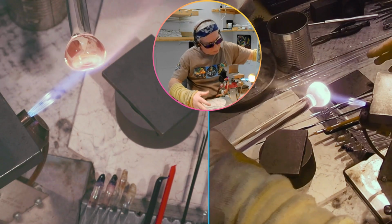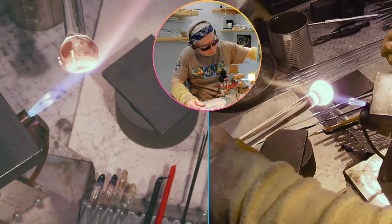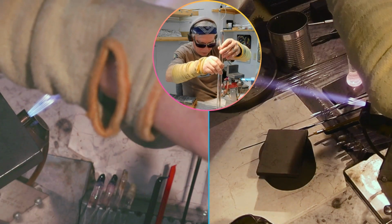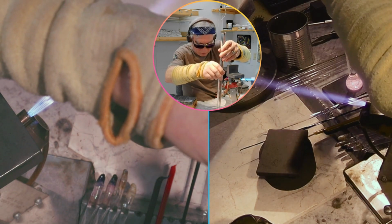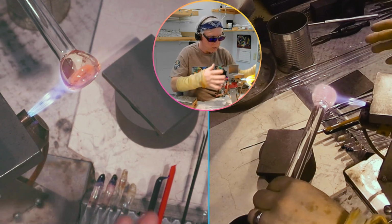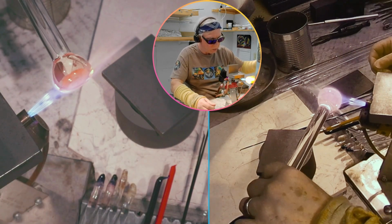So it's already encapsulated a lot of this, and able to focus a little bit more heat right in the belly button there at the end. And again, I'm letting it touch that graphite pad, but kind of holding it up. So we get past the main compression phase. Now I need to at some point here transition this to a cone-shaped end.